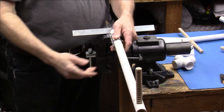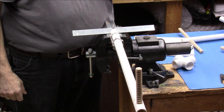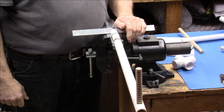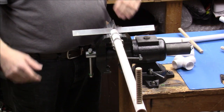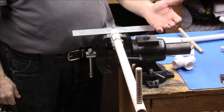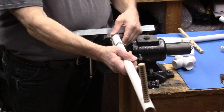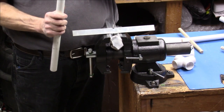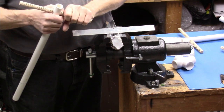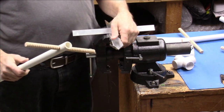When you get done building this and you say it only resonated at 190 kilohertz, 200 kilohertz, something like that, well then, how could I make that go higher or lower? We're going to take turns off and find out exactly. But if you wanted to make it resonate all the way down at say 100 kilohertz, then what would you do? Well, you'd make this a little bit bigger, or maybe you would add a couple of turns. So this is not exactly how to do it. This is a platform for you to experiment with.